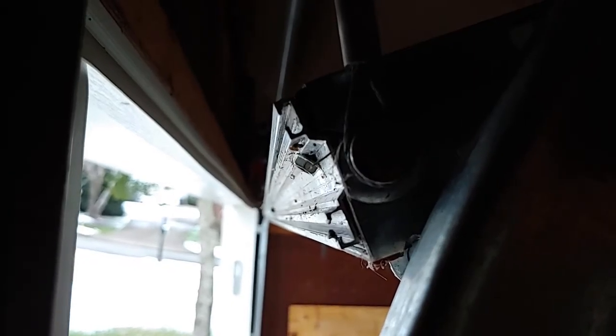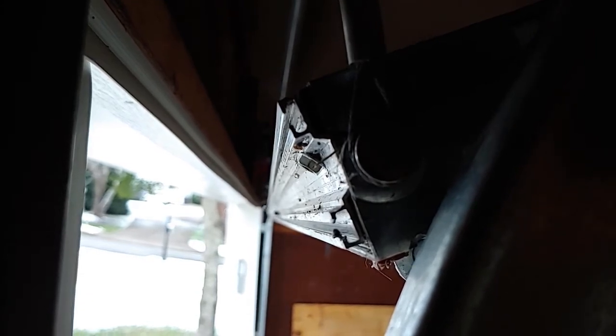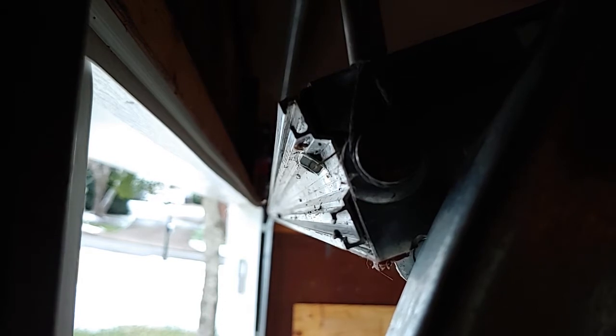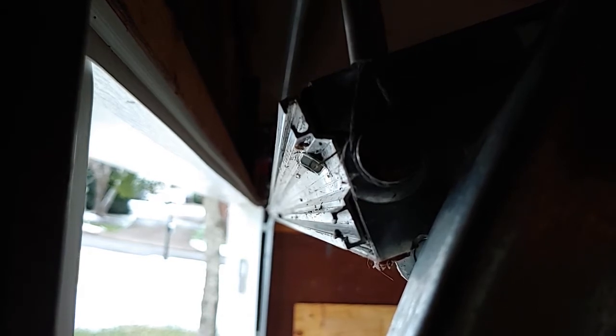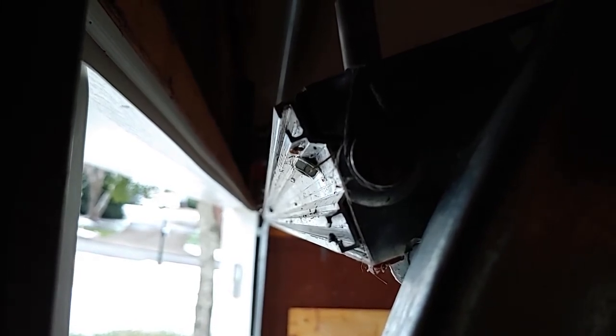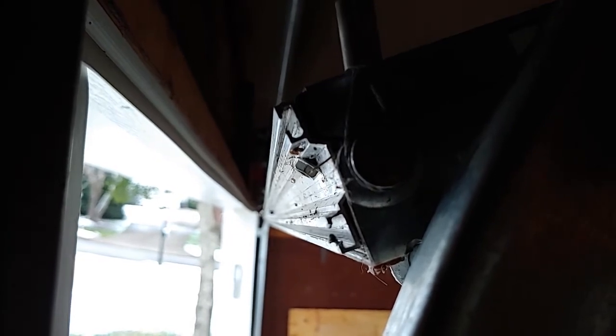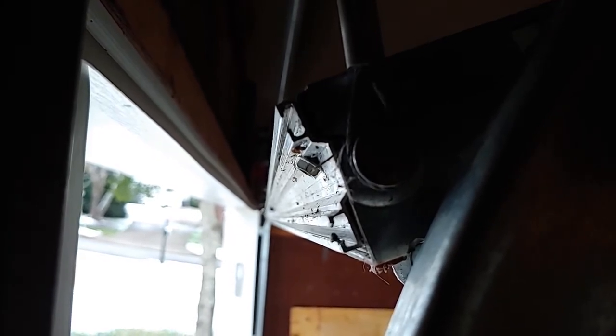So here's the track. You can see the two C-notches, and those two C-notches — you're going to put each lip on the rubber seal in there and just slide them right on down, 16 feet of it. So I'm going to get it started. I'm going to reposition the camera and we'll show you how you can slide this on, do it yourself.